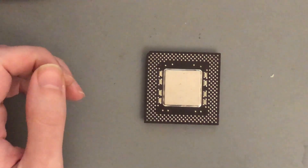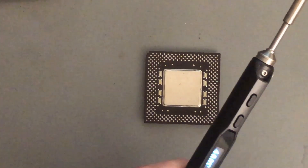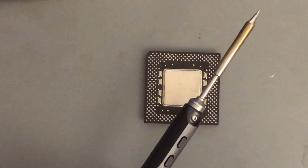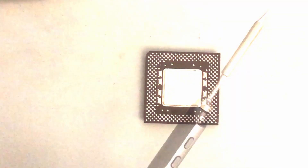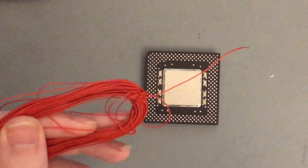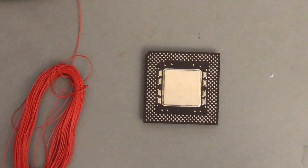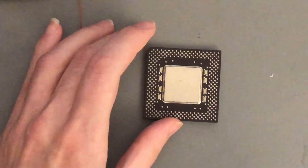Now let's discuss the modding process, starting with the tools. First, you want a quality soldering iron with temperature control and a fine tip — I'm using the classic TS-100. The most important consumable is this electronics repair wire, 0.2 millimeter diameter, which I really recommend everyone get. Finally, some Kapton tape and maybe some classic electrical isolation tape.